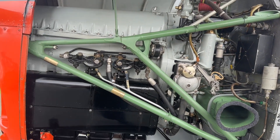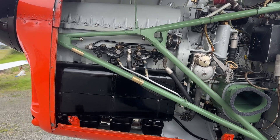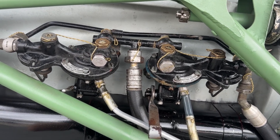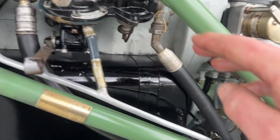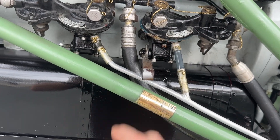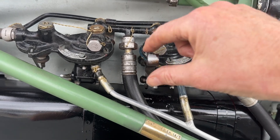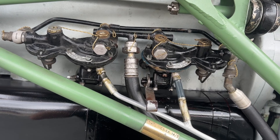This is kind of the least spectacular side of the engine, but it has a couple of really important parts. It's got the fuel pumps — two engine-driven fuel pumps. Fuel comes in the pipe on the right from the fuel bowl down the bottom, up through one fuel pump, another fuel pump, and then off through this outlet back to the engine. It's also how we prime the engine, and to prime it we have a little priming handle which moves the diaphragm on the rearmost fuel pump up and down.